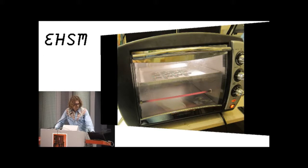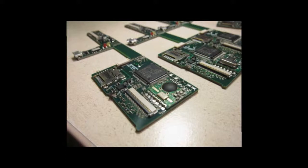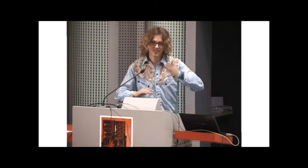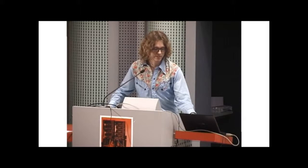The oven is a super cheap toaster oven from Argos — maybe 30 euros. The industrial equivalent costs about 5,000 euros and they are identical as far as I can tell. That's what it looks like when it comes out of the oven — all the solder paste has melted and formed good solder joints. Unfortunately I couldn't design the PCB to fit into the curved glasses, so I had it as one PCB for testing and then finally to put it into the glasses I had to cut out the interface bus between the two eyes and replace it with lots of bits of wire going through that slot.